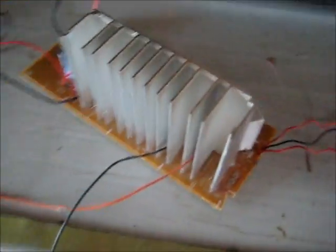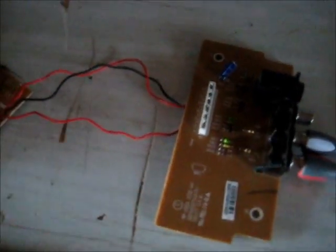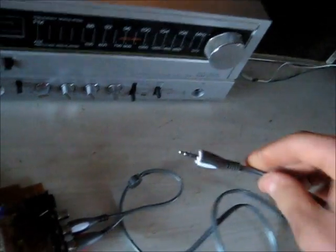Good day viewers. I've made some improvements to my amplifier. I found that these are the RCA jacks from the front panel of that TV. I've utilised the left and right channels. I didn't solder these straight to there — I utilised these components here. There are blocking diodes and stuff in there, and they're important in case something happens — they might shoot voltage back up into whatever's plugged in here, say an iPod, and destroy it. So I left the circuit properly.